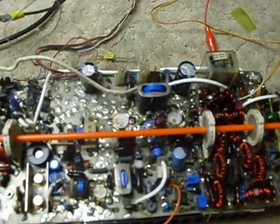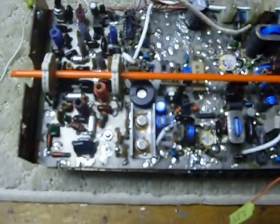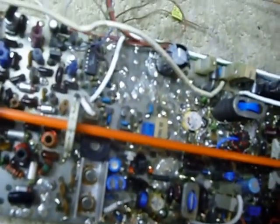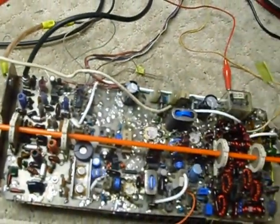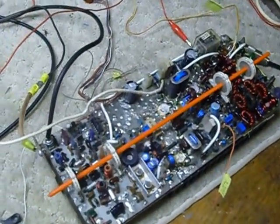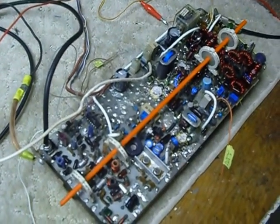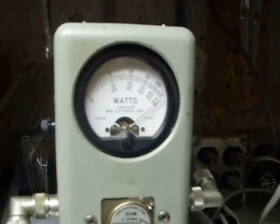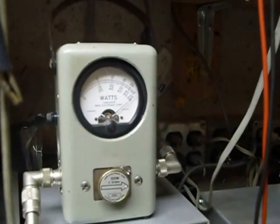What I wanted to show you is that this thing actually works now, and we're going to fire it up here. I've got it on 160 meters. 160 meters is the band that it is very difficult to get going on these — I really don't know why — but we always checked out 160 meters on them first. I have checked all the bands, and they all do 100 watts, which I'm real happy with. 10 meters only did 90 watts. I'm going to turn on the generator here now, and there's our output — over 100 watts on the bird wattmeter. Now that's on 160 meters.